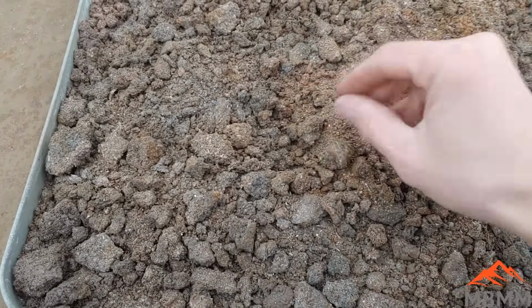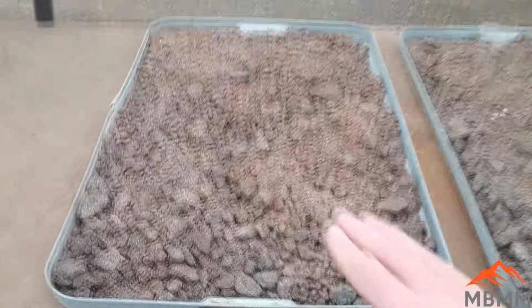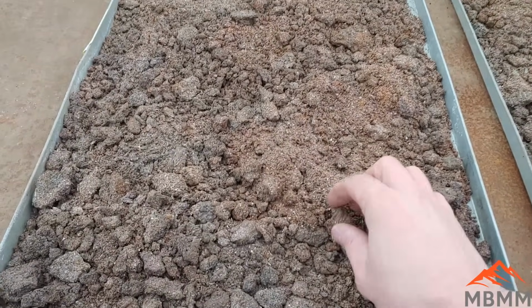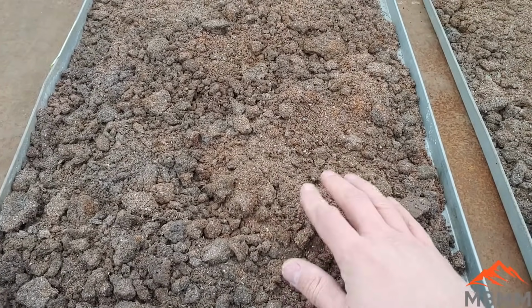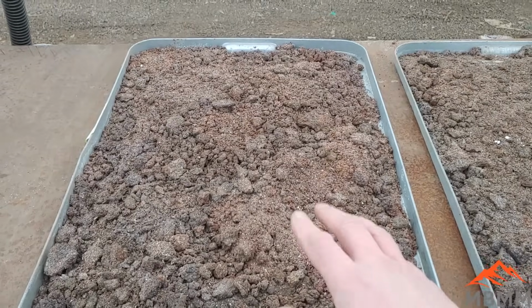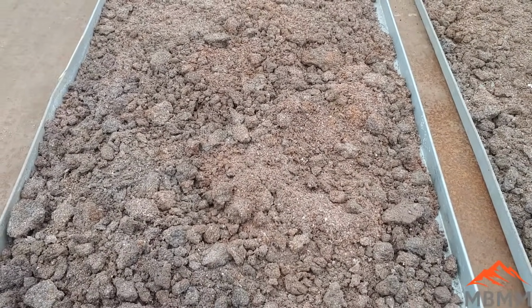And so I'm going to do a couple different experiments. The first one is going to be taking this stuff, adding a little bit of sulfur, about 5% by weight, in with some flux, smelting it down, and trying to keep all the copper and the other base metals in metallic form and make an alloy that we can then look at electrowinning away.